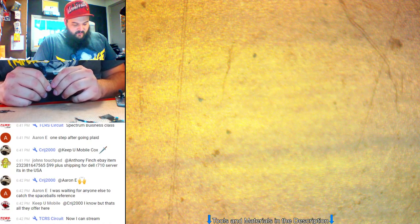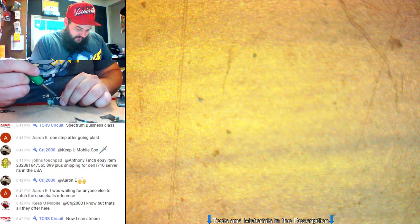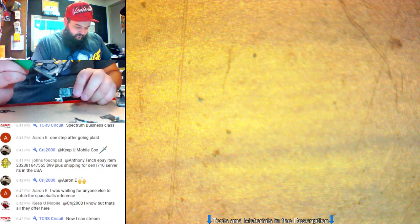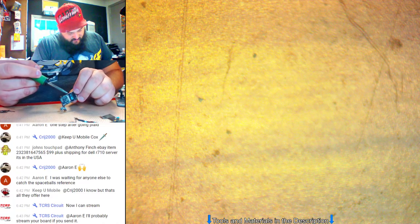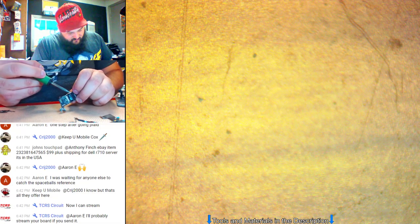I have no idea. I've never run into something like this. Usually they'll always go into recovery mode. And this one won't even go into recovery, and when it tries to, it says that the USB device is not recognized. So that tells me that something is wrong with the data communication between CPU and USB. Our CPU and USB lines check out. Put a new TriStar on, checked the resistors by CPU. They check out. So my guess is a CPU related issue.